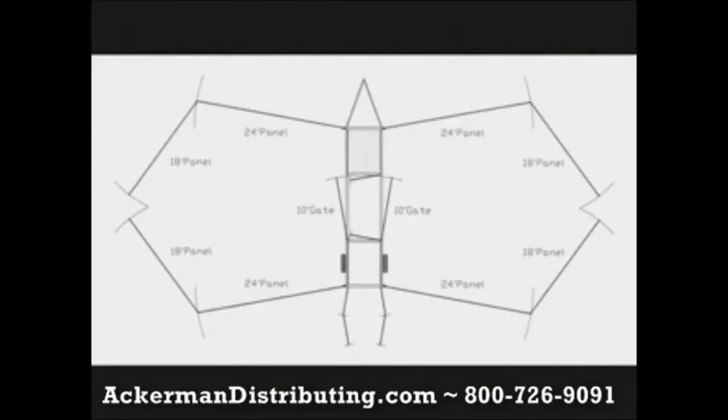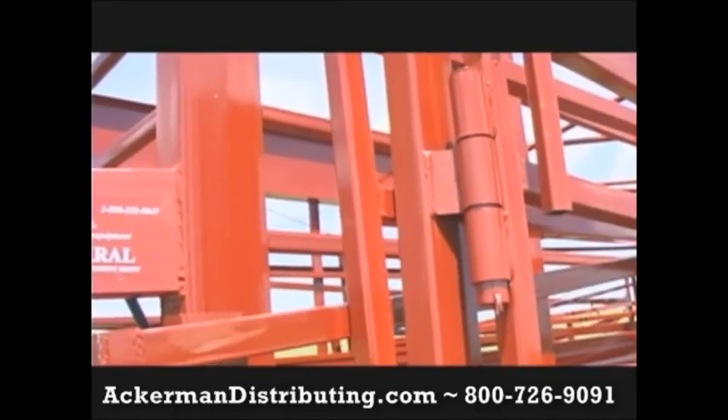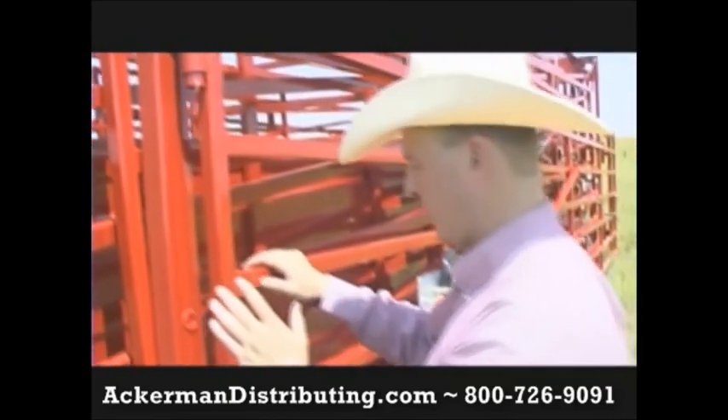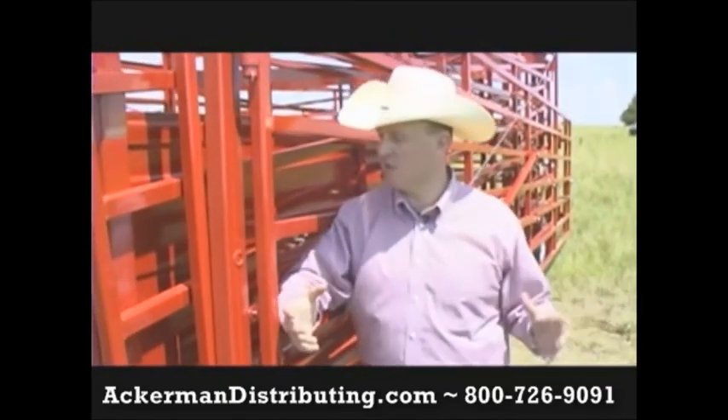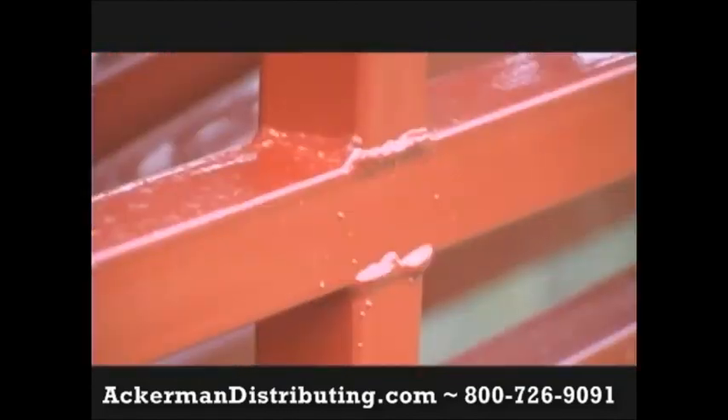Titan West makes roundup extremely easy because the OK Corral is a portable corral system — it's a single unit — and it eliminates the need for transporting and setting up individual corral panels. Let's talk construction of the OK Corral first. The main portion of the corral, the wings that we're going to be folding out in just a little bit, are made of inch-and-a-half square 14-gauge tube.